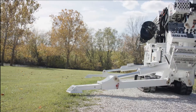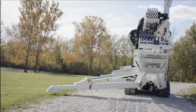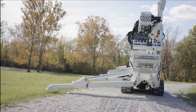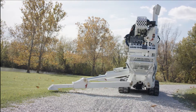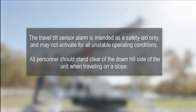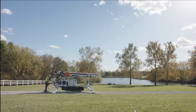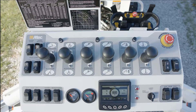Move the track slowly and avoid sudden and jerky movements. Consider lowering the outriggers close to the ground on the downhill side to prevent rollover in case of instability. These limits apply to all operations to include loading and unloading. The travel tilt sensor alarm is intended as a safety aid only and may not activate for all unstable operating conditions. All personnel should stand clear of the downhill side of the unit when traveling on a slope. Prior to testing the controls, ensure all objects and personnel are clear of moving parts. Before setting the outriggers, test the boom interlock system by placing the control selector switch to the lower tools position, then move the lower boom control to the raised position.